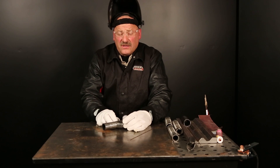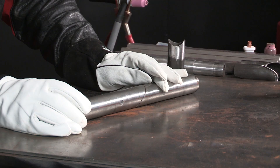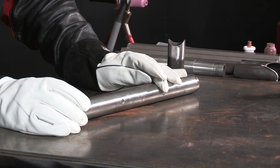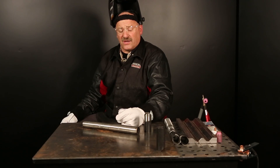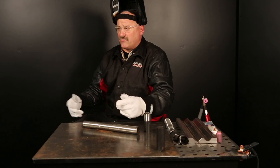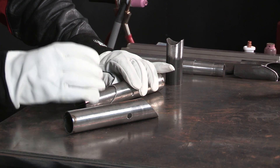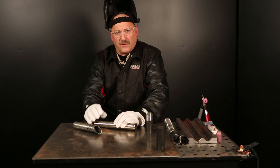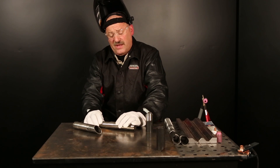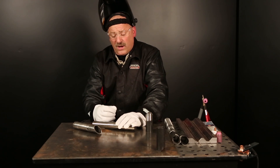Hi, this is Carl Hose from Lincoln Electric, and today we're going to talk about welding 4130 chrome moly tubing. Now there's a lot of different kinds of chrome moly — today we're going to be welding on tubing which is less than an eighth of an inch thick, and there'll be no preheat outside of room temperature required. Typically when we weld high strength thin wall tubing like this, it is gas tungsten arc welded. Some industries might MIG weld it, but we're going to be TIG welding it today because sanctioning bodies and a lot of codes actually call for gas tungsten arc welding due to the quality of the weld.